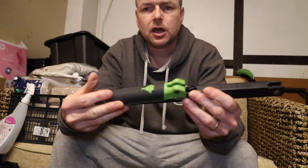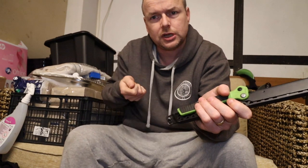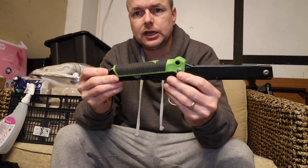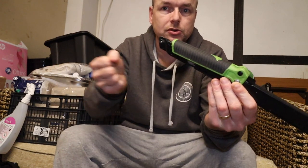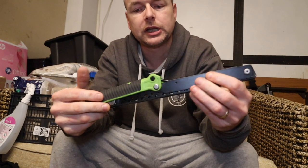It's not something I'd ever do because I don't believe this blade can snap as easily as some of the folding pull saws. Using those, I've myself bent blades and snapped blades. Whereas I've never had trouble with this because it's a proper bow saw — it cuts forwards and back, the blade is under tension from both directions. Whereas with pull saws, if you try and push you can bow the blade a little bit.